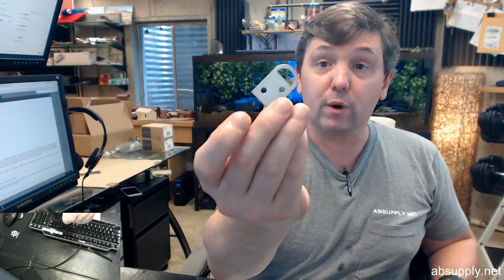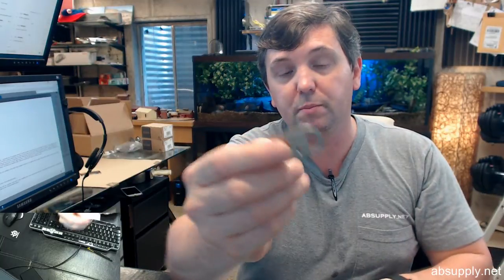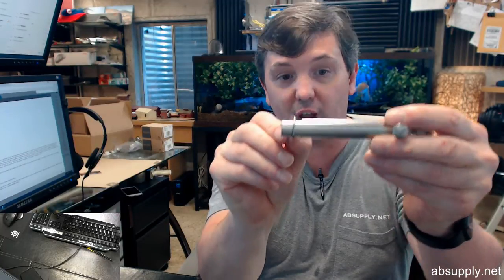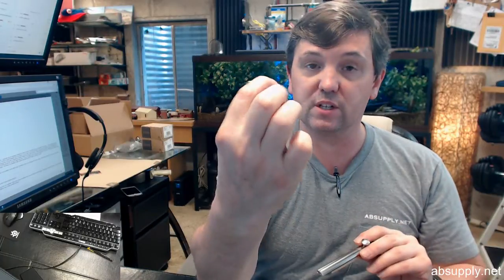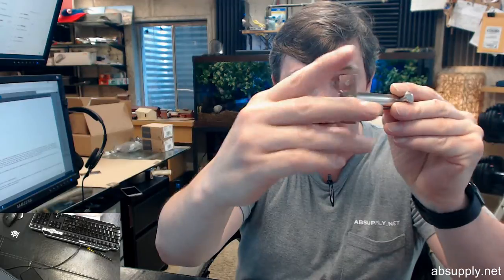You'll have what's called a rim strike, and then you'll have what's called a mortise strike. Okay, so a rim strike would be used in that scenario where you mounted the surface bolt on the pull side of the door, it'd be very appropriate for you simply to surface mount this onto the rabbet of the frame, and then you'd have your locking scenario like this. Now, a mortise application would be as if you're going to mount it on the push side of the door, where this would be mortised to the header or to the jamb, and then of course your installation will look like that.